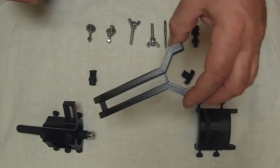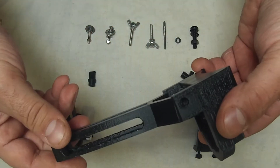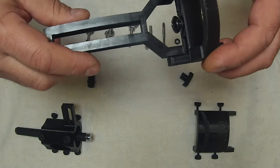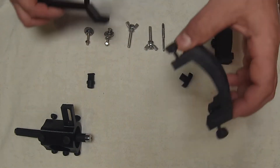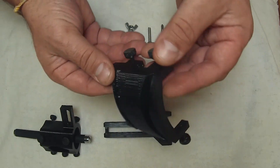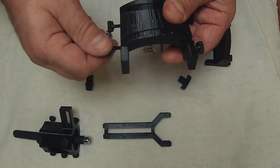I have built-in supports for all these things that are easy to pop out, and large holes. The azimuth adjuster on the right and on the left is an extension arm, so you can mount many things to it and adjust it up or down on the mount. The azimuth adjuster uses a single 8mm screw — about 20 or 25mm length, anything you have laying around. This is a top mount for mounting a laser to the polar axis at almost any latitude, using thumb screws to attach or zip ties on top if you want.